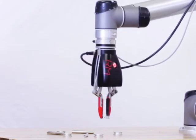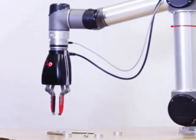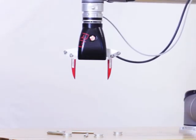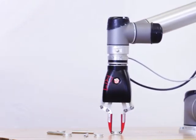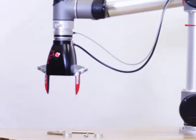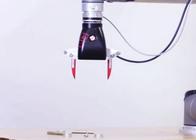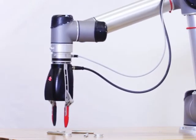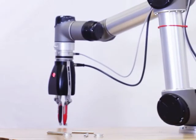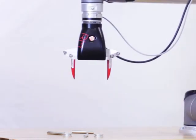This is pretty much how it will look once you start looping this program. The robot will return to waypoint 1, take a look, select the highest object, drop it, and so forth. In case the hand doesn't find an object to grasp, get object pose will return the arm's current pose. Use the command get object info to retrieve not only a pose, but also a binary variable as to whether the hand found an object, as well as the optimal grasping aperture to minimize collisions of the fingers with the environment.